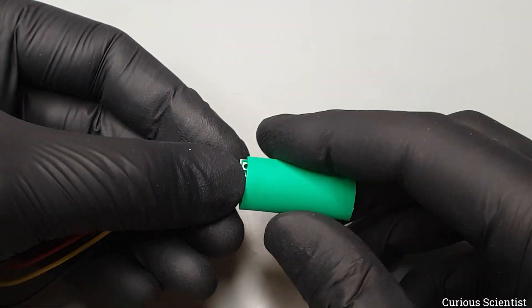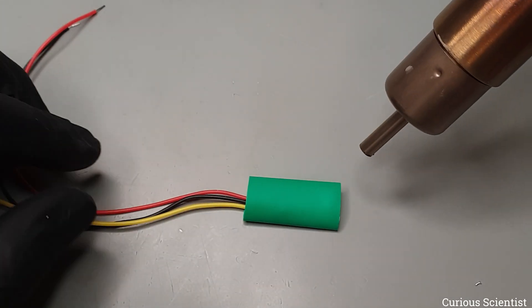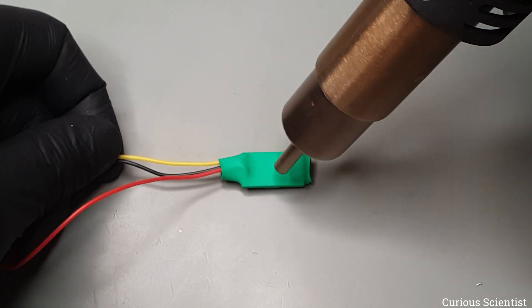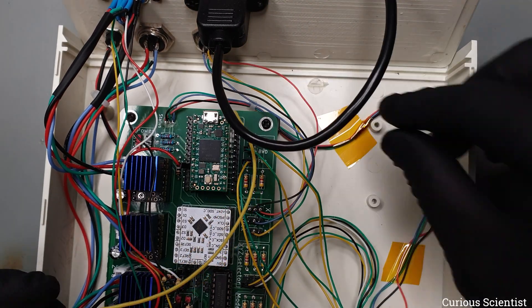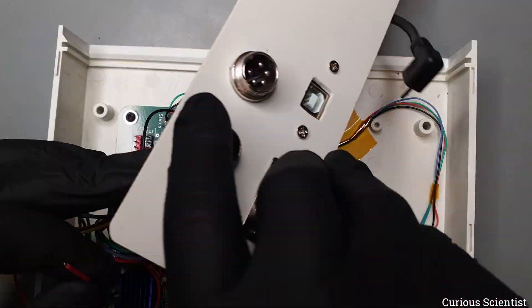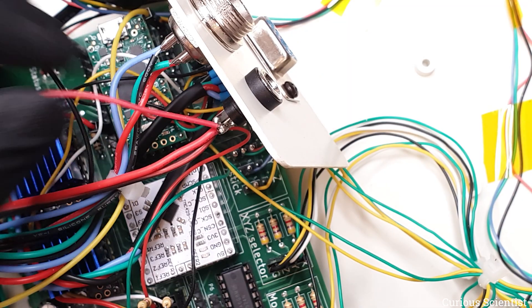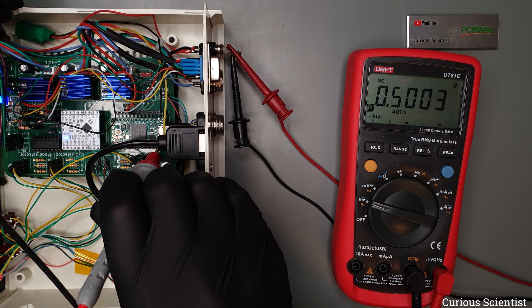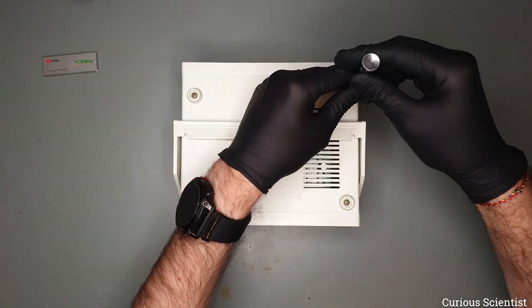To make the board safer, I wrapped it with heat shrink tube, because the board will sit loosely in the enclosure and the heat shrink protects it and the rest of the circuit from accidental shorts. After wrapping the voltage regulator, I finish up the cables by crimping the connectors and soldering the V-in to the DC jack. I am careful and power up the device from a regulated power supply so no high current can rush through if something is shorted. As you can see — or cannot see — no smoke is emerging, which is a good sign. All the LEDs are lit up, and when I check the 5V rail it shows the correct voltage. Let's pack everything up and test the device in a real environment.